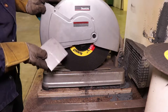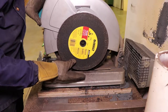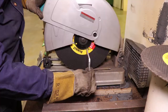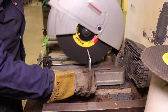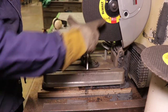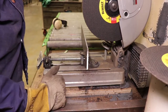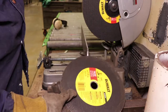However, you could see that if the blade was worn down — here's one that's worn down partially — I may not have been able to make a complete cut all the way through the part. So you might have had to either lay it flat or adjust the clamp accordingly, because if the blade is too small it won't be able to cut all the way through. It's a 12 inch blade in a 14 inch saw. If the blade is too worn down, just contact the shop technician and they'll get a new one swapped out for you.